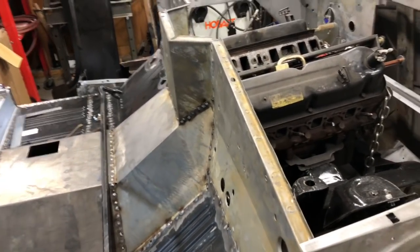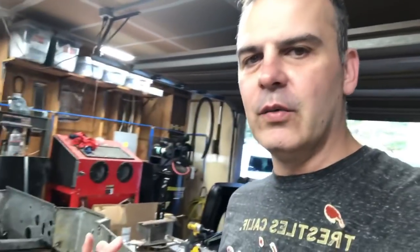So it's kind of a total S show here in Matt's Garage. It's ridiculous. I had so much work into this, and I wasn't careful. One of my takeaways is you got to get yourself a laser level. They are absolutely critical when you're doing a build like this, because the floor in your garage, your walls, how the car's positioned, all those things play games with your eyes. And the fact is, you can have a square with you, but if your basis isn't square, then it doesn't really matter, if that makes sense. So angle finder, laser level, these are all critical tools for doing a good job on these body builds.